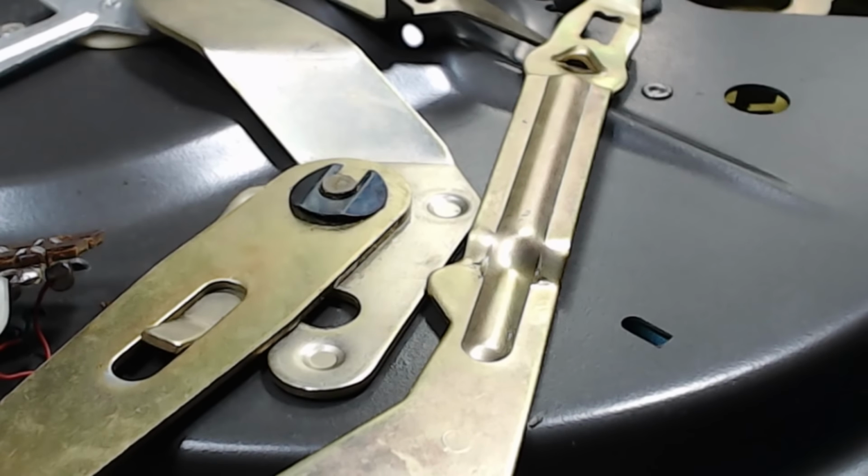There you go, much better. Put a bit of grease on it. I could just oil it, but the grease has the oil captured in it, so it can keep lubricating long after a drop of oil will. I think I should use a better applicator than that. That one's just getting it everywhere. Put some down the bottom here. Once again, take the excess off. And I'll put a drop of oil here. Another drop down the bottom. Very smooth. Right, time to put it together.